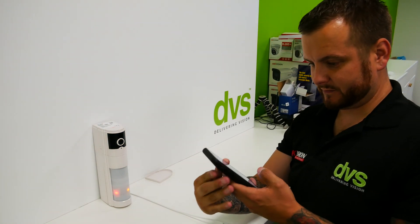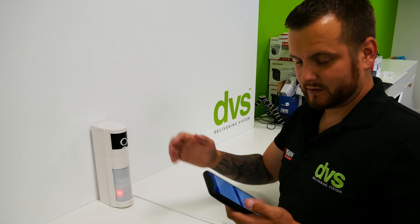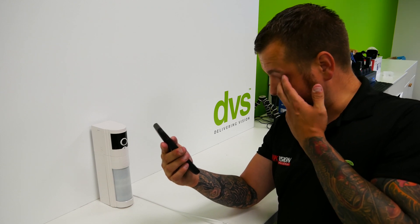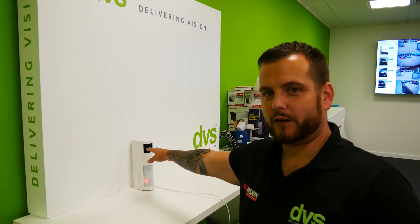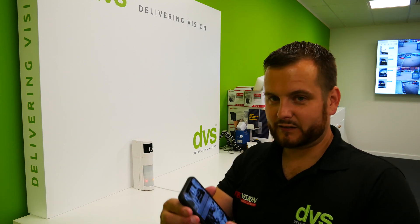The device is connected — modify the device password, and it's now setting up the Wi-Fi connection to the app. The system is now rebooting — put the lid back on and wait for it to reconnect. We have it all fitted and working. The PIR is picking up. Don't forget it's 180-degree field of view on that camera, 2.4 GHz Wi-Fi only. It doesn't currently support exclamation marks in the Wi-Fi password. It's only 2 Mbps but you can throttle it back if you have bandwidth issues, and you can plug in an external Wi-Fi antenna if needed.